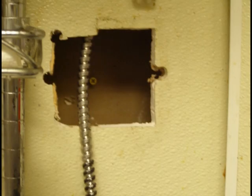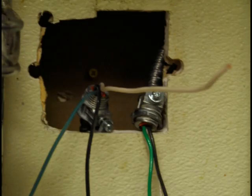In the first diagram you can see that we went from a single gang to a two gang with new 12-2 BX going all the way to the panel. In the next diagram you see that we ran a second wire to an outlet below and on the opposite side of the wall. Note that the terminations are already attached.